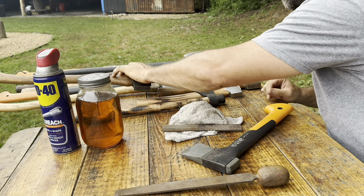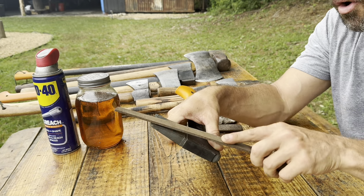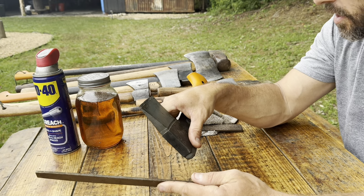The convex grind gives the edge more durability — it's going to last longer and is less likely to get damaged hitting something hard. That convex shape also makes it quite easy to sharpen, because the angle doesn't have to be perfect. You can do a rounding motion when sharpening. Axe sharpening purists will say there's only one right way — but if your axe gets sharp at the end of the day, your method works. Same with knives. There's no single right way, but there are some wrong ways.